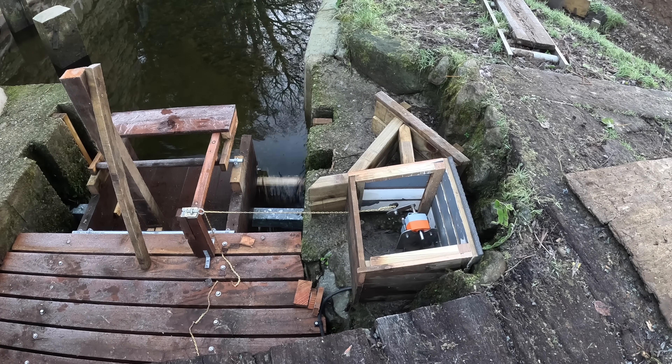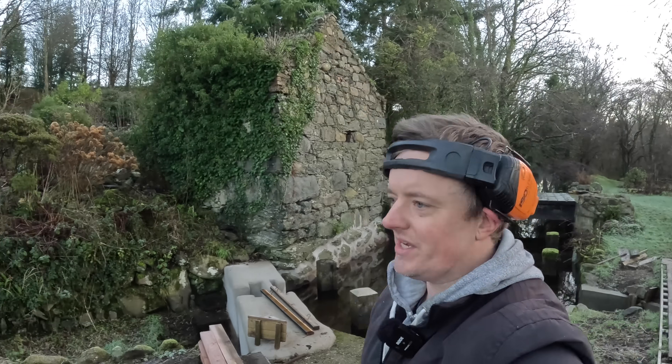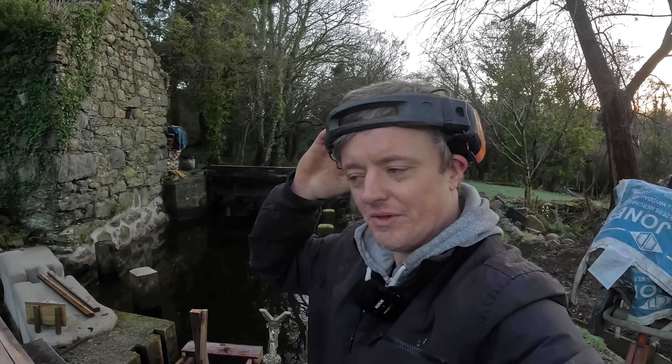So I'm going to imitate a failure — basically make the controller think it's gone over speed by pulling the relay out, and you'll see how it functions. I'm pulling the relay out now... there you go. Pretty nifty — very simple, very effective, and fail-safe because it retracts like that even if there's no power. I reckon that's pretty nifty, to be honest.